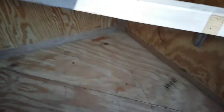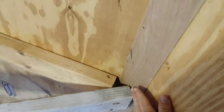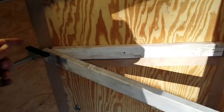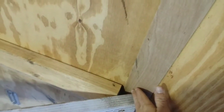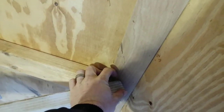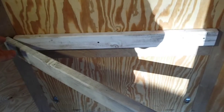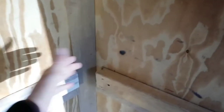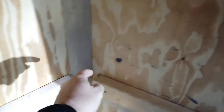Sorry, I know this video is getting stretched out, but this will help you guys if you want to make a shelf. What I'm going to do is get my piece of plywood, then measure from that end to that end. You figure about one or two inches up on the edge — same over there — and up here find somewhere kind of in the middle, so it'll be about three inches or whatever. From the two-inch to this three-quarter, same over there, and you take that three-inch swath and do the math on both pieces of plywood so that three inches is right in the middle. Then just take your chalk line and snap a line to that edge of the three-inch.